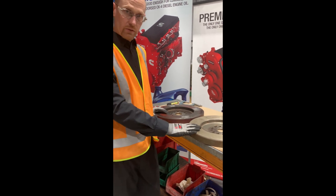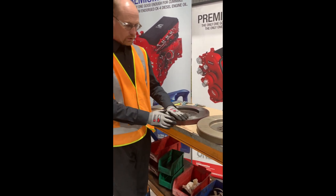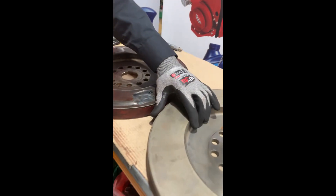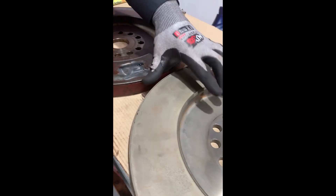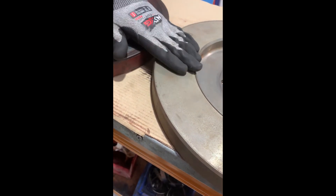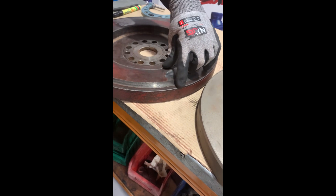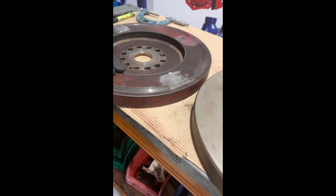To identify which damper you have, look at the surface edges. The new style damper has a rolled edge with a chamfer on the inside and outside, rolled to hold the faceplate in. The original 4101884 has a visible weld edge on the outside - a friction weld process used to attach the front covers.